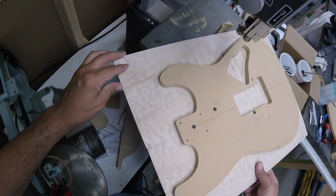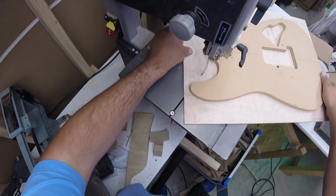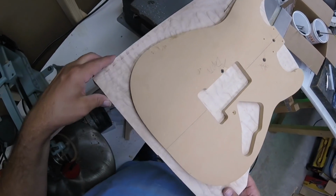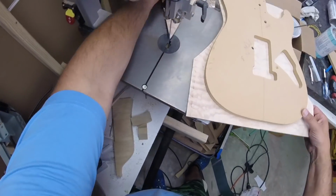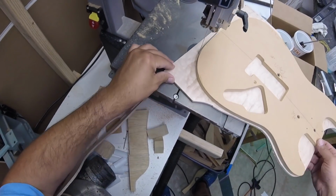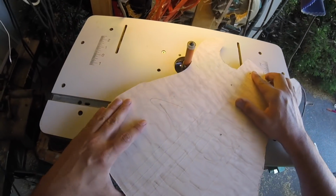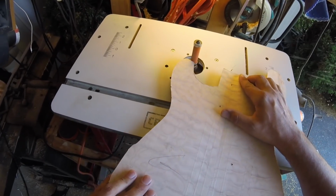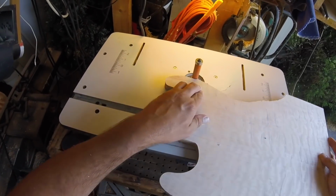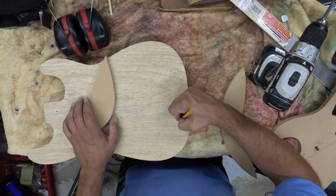And we'll do the same thing with the top, but since I'm going to bend over this arm, I'm going to leave the one side out. So as I'm cutting this, you'll see me leave this side right here thick, and just finish cutting this off. Same thing upstairs to the pin router or table router. Just get this flat so it will glue on straight. Leave that edge. And then here's where the bend over is going to be.